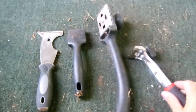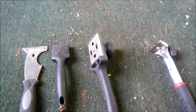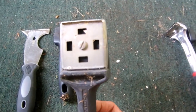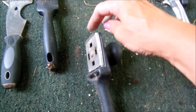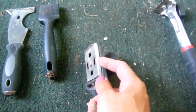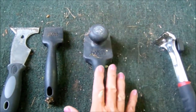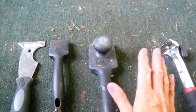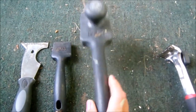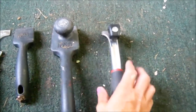I highly suggest working in small sections so you can go back and prime it, because if you come back the next day you might have further feathering that needs to be addressed. This larger scraper is about two to two-and-a-half inches square with a changeable carbide blade — I've already worn down one side so you flip it over and use the other side, then flip it upside down again for two more sides. The larger ones have a push-and-pull knob for leverage on very hard old siding and chunky paint, and it doubles as a tool for hammering to tack down any loose wood.